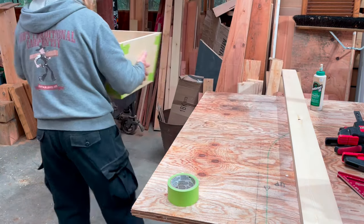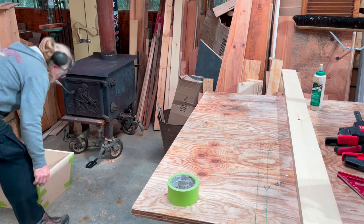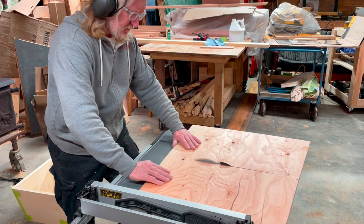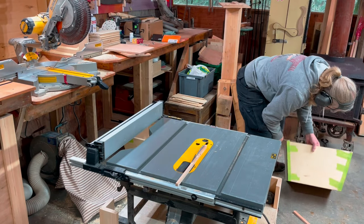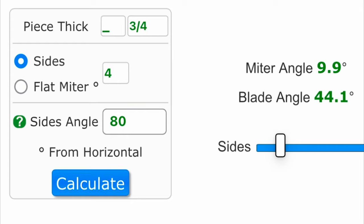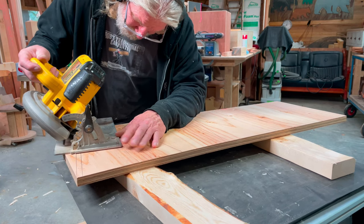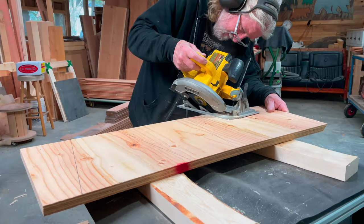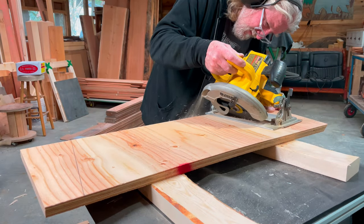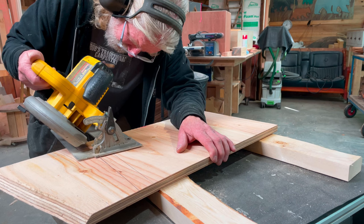The glue for these planters can now dry or cure. In the meantime I'll show you how to cut the particular miter with a circular saw. On this one I am going to stick with the same angles. I set the circular saw to 44.1 degrees, and as you can probably imagine it's more of a guessing game with these little machines than perfection. More precise should be the 9.9 degree pencil mark on my plywood.